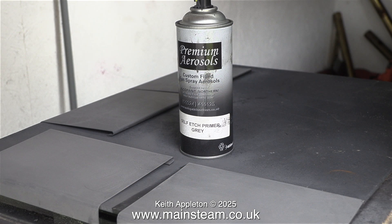Two of these side panels were already painted; the other two were anodised but damaged. I rubbed them down quite vigorously with 400-grade wet-or-dry sandpaper in order to scratch the surface and key them for the new paint.